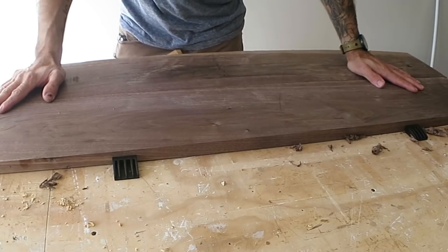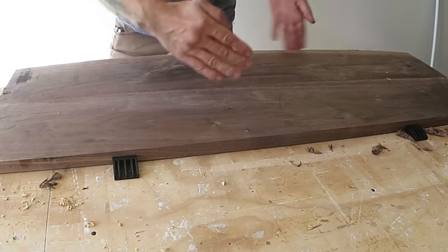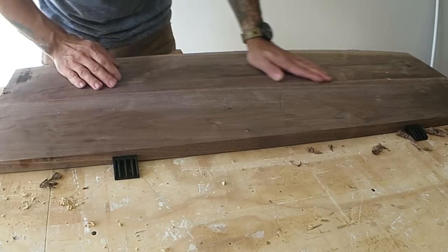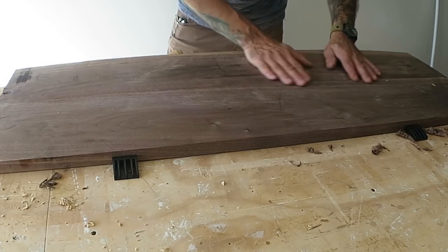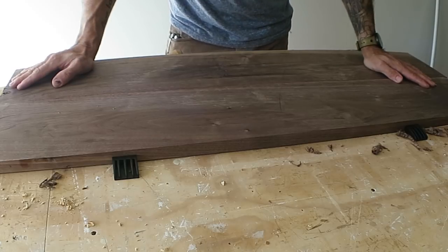So amazingly, we're pretty flat. The boards are pretty parallel — this thing is not far off being bang on, which is good. There's a little bit of height difference between the boards just here, so I'm just going to smooth this off and hopefully don't get crazy amounts of tear out.